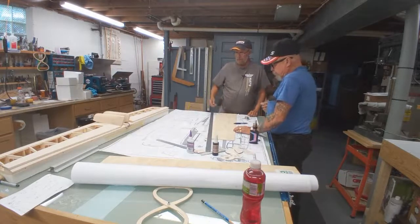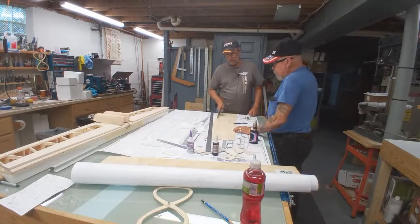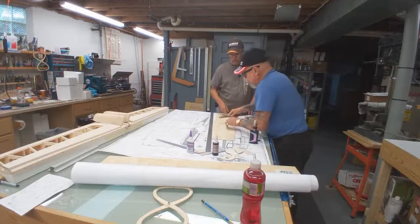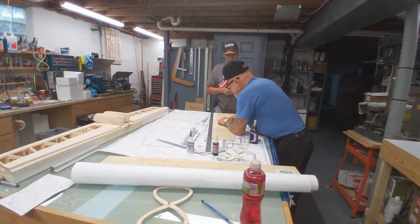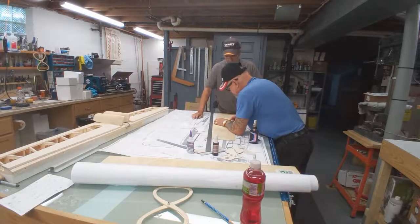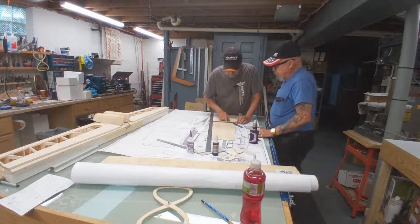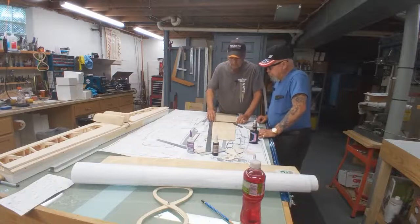So that's all you got to do. If something looks off here and you're looking down through here and this side looks bigger, then measure from the center line to the line on both sides and see what's off, whether the tick mark or the... This ruler's got so many damn marks on it. Inch and three quarter. Yes. See, that's the center rule. You can take this and put this on the center, and it comes out 1 3/4. Okay. That's how you use that rule.